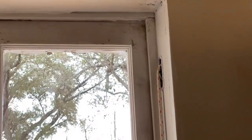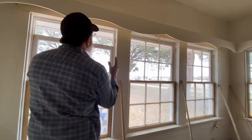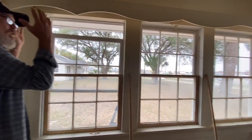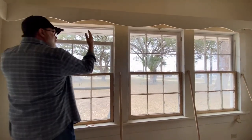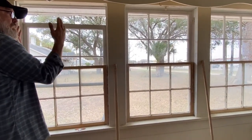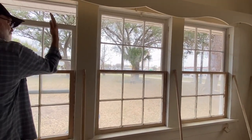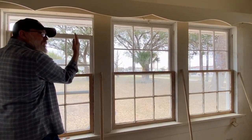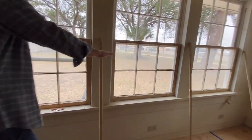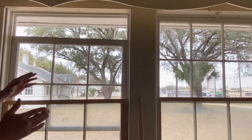Okay, well, a couple of things. We're gonna go through and I'm gonna tweak and adjust these, but when the house shifts and it falls this way, you've got these rectangles here, they're all connected, and the parts of the rectangle that are vertical like this tend to stay parallel. Eventually they could move, but mostly what you're dealing with is the bottom, which is like the sill, and the header that are now at a slope. And there are different ways that you can address that.